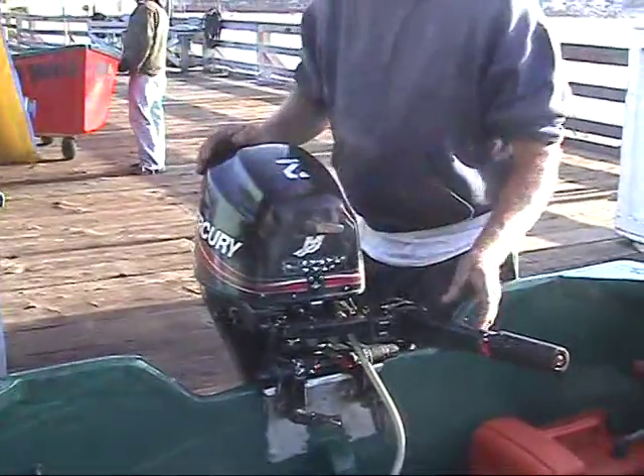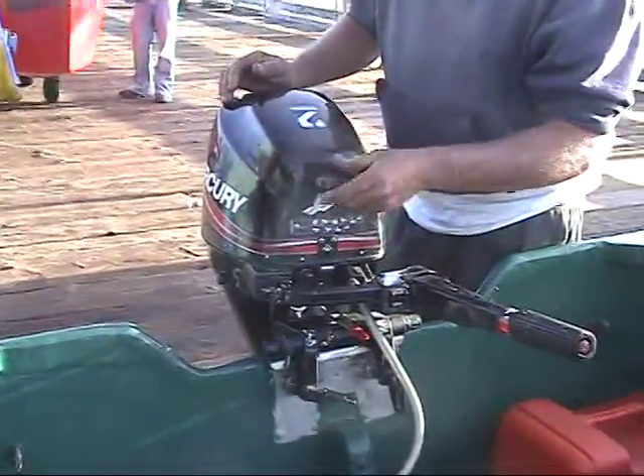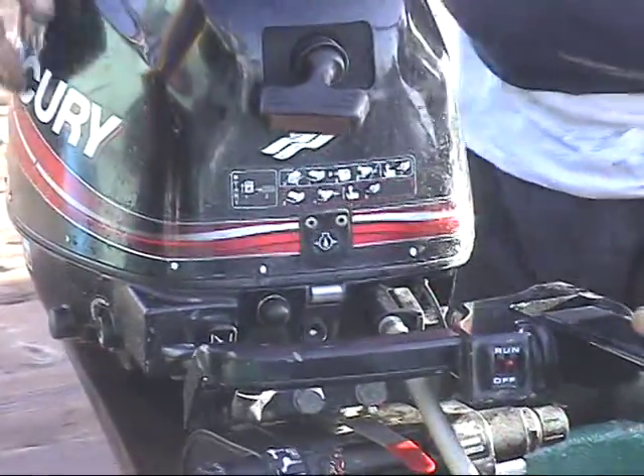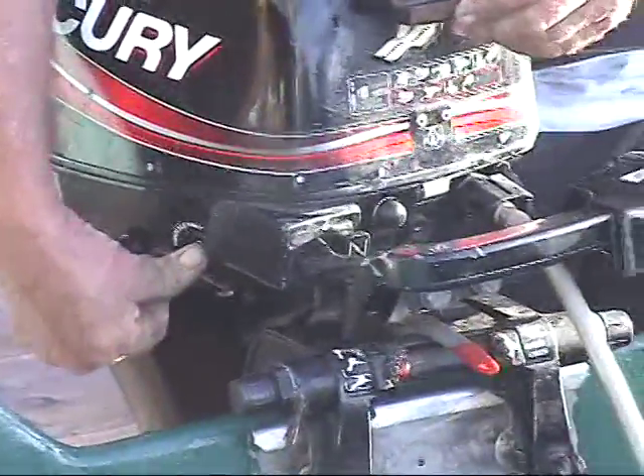Last thing — what used to be my biggest problem with these motors: sitting for a while, motor off, try to start it in a couple of pulls and it won't start. Run switch is on, fuel's connected, line's not pinched. Use the throttle-only button by pushing it in while it's in neutral where the rope would pull.